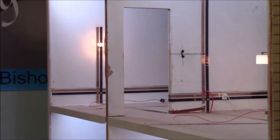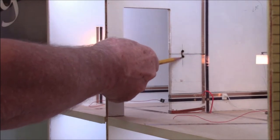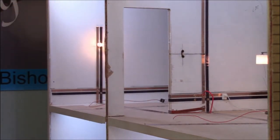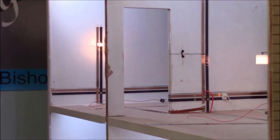them completely. You can see that I already have drilled the 1/8-inch holes in the wall here for the switch to be mounted in there. And we need to be able to take the wires that we have soldered onto the light switch and bring them to a point where they're going to actually turn on and off the individual lights.